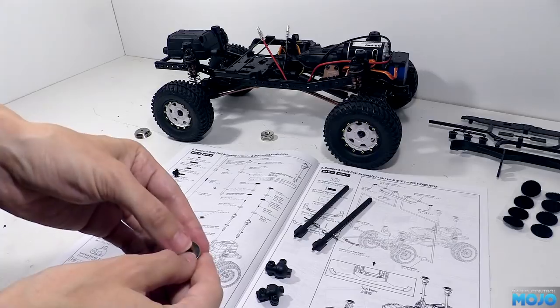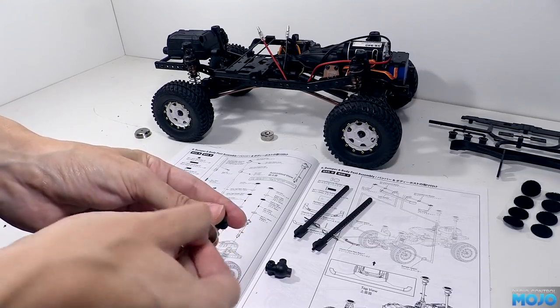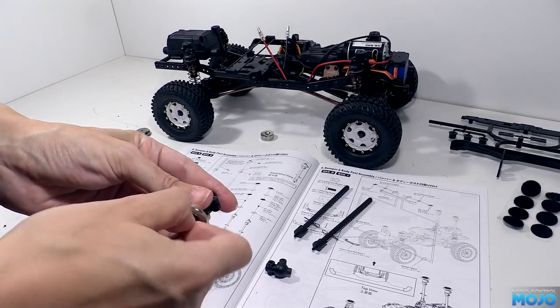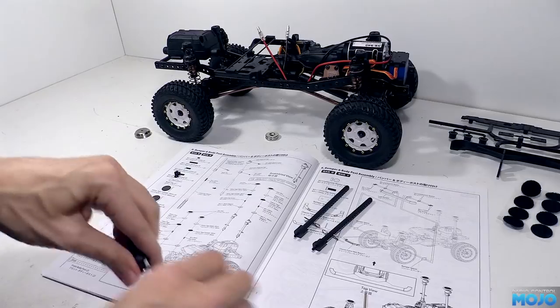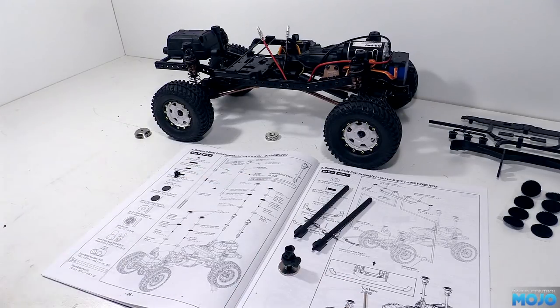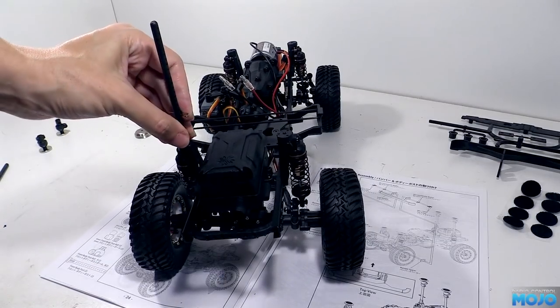The magnets are really quite strong, so they have a tendency to jump to strange positions. We need to tighten the screws just enough that we can't freely spin the magnets. There's no point in doing them up any tighter, it just risks stripping the threads. The rear posts get screwed into the top of the rear damper mounts, but we haven't got a hope of being able to thread them in.